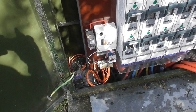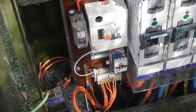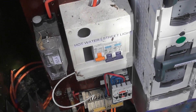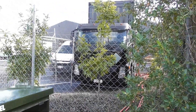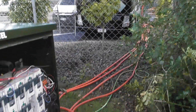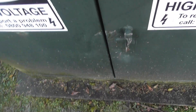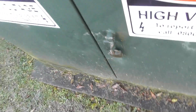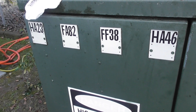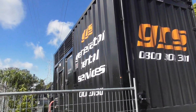The process I will explain: I think they put a new transformer here, heaters were turned off, it piled up water which normally feeds the heater. We've got a temporary generator in here at the moment. I don't know when this thing was put in, but it was moist, and eventually we created a flashover. Temporary supply on diesel, 800 kVA.